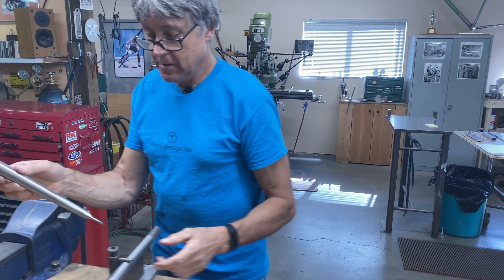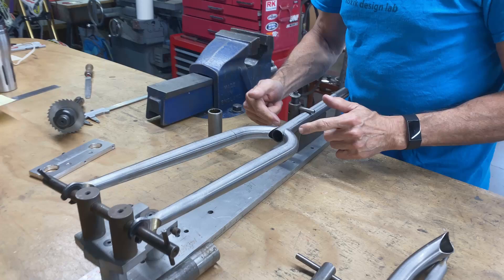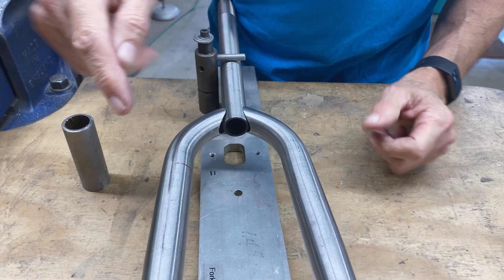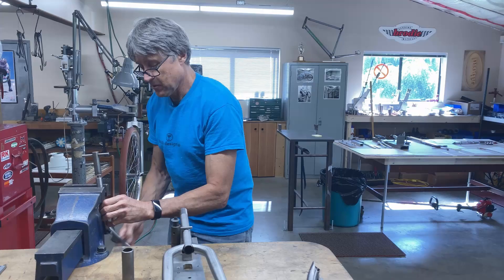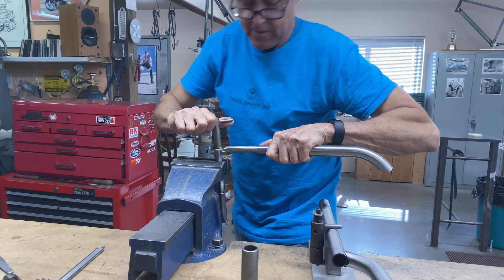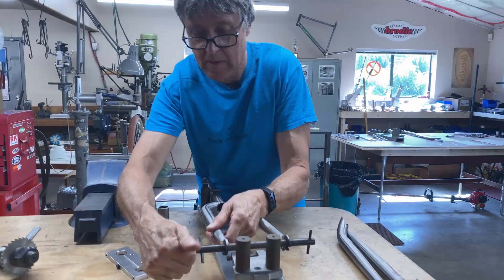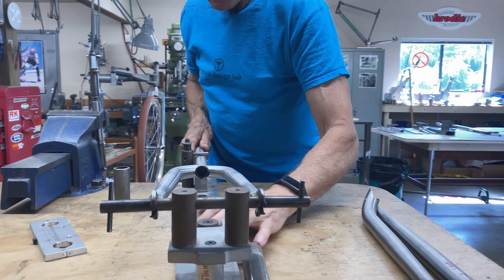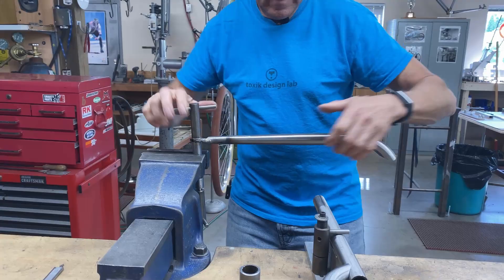This is a fork jig that I made a long time ago. I need to bend these a little bit — it's not contacting onto the steer tube because I set the dropouts for the old one and now it's the new one. I need to bend them in just a little bit. I'll hold this in the vise — it doesn't need that much force, I just want to bend it down just a touch. There we go; we don't want a space there. I'll push this in a little bit and do the same on this side. There's no heat involved so I guess you can call this cold setting.